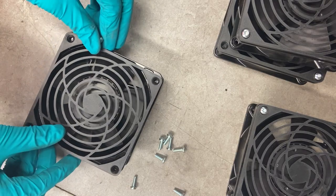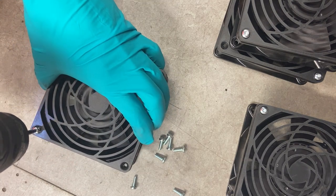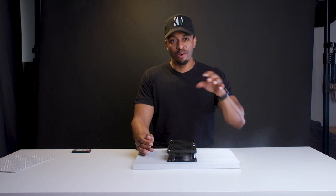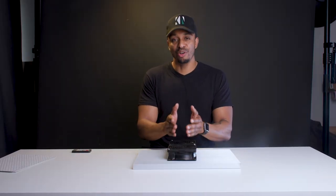I added grills to protect the fan blades from damage — and to avoid accidentally chopping my fingers off. Note that there is no speed control on these fans, so as soon as you apply 48 volts they'll spin at 2500 rpm. You're definitely going to hear these fans, so think about that if you need to record audio in your video as well.